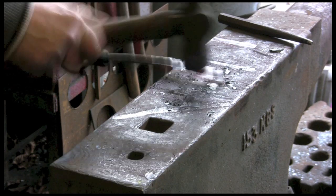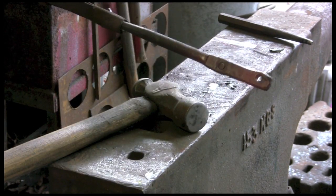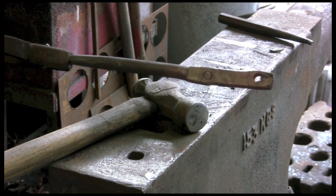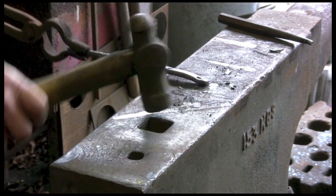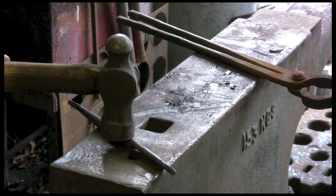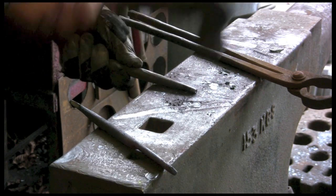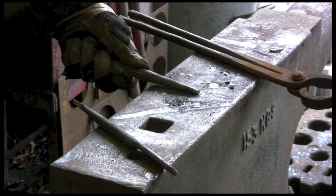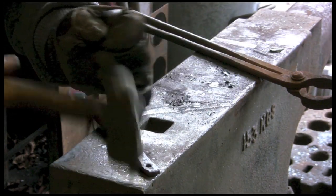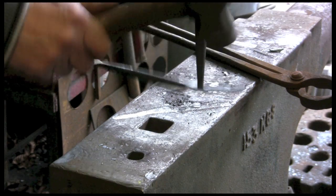The little nibble hasn't popped out, but it is actually sheared. You can see quite nicely there that it is sheared, so it just needs another punch out, and that'll drop out. This is where I spot my punch has been bent, so tidy it up. It's actually quite hot still, so it's not going to snap or break. Just punch it out. It's knocked out the nibble.